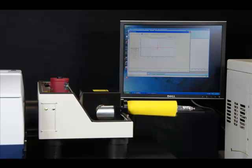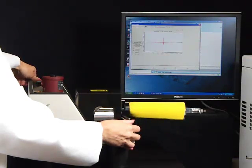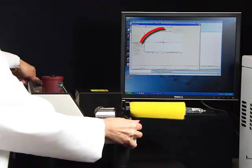Make sure the MCT detector is sufficiently cooled down. Turn the spectrometer on and start the FTIR software. Make sure the spectrometer is set to recognize an external detector. Open the diagnostic screen displaying the system energy or interferogram. The GC FTIR accessory has been pre-aligned and at this point you should be able to see a signal on your computer screen. Note the energy level.